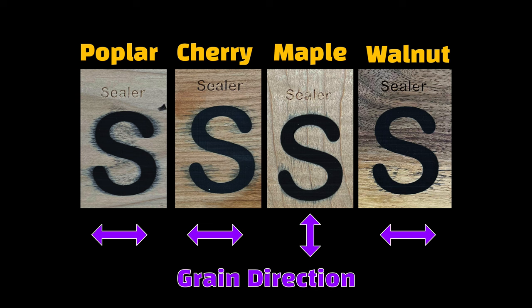Okay, next we're getting into the results that surprised me the most — here is the sanding sealer. I was really shocked by the amount of bleeding on all the wood species. I have used sanding sealer before with paint and I've never had this level of bleeding. I'm wondering if the longer cure time for the epoxy versus paint allowed more of the pigments to penetrate the sealer. Now, as I've mentioned earlier, I only applied one coat of the sanding sealer, so I'm wondering if more than one coat would have provided better results. Perhaps we can do a follow-up video — if that's something you're interested in, please leave your comments down below.